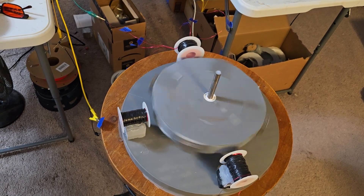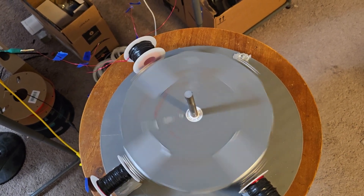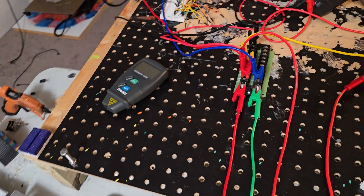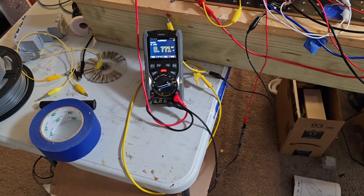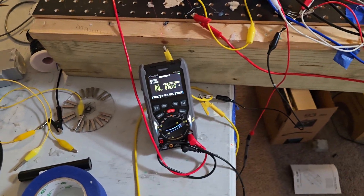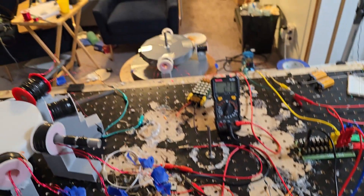I can't tell whether it's spinning on my power or not, because it spins so well — those ceramic bearings are awesome. Last time it was up around 2 amps, 2 and a half, 2.7 amps. Where'd my amps go? Oh yeah, we grounded the coil — that's probably what's happening — and this is probably gonna run now.